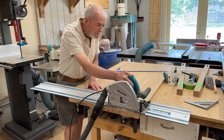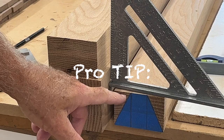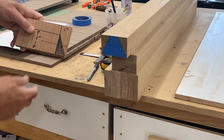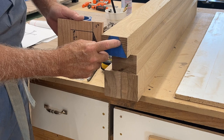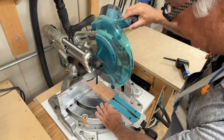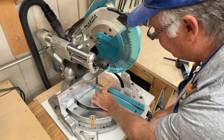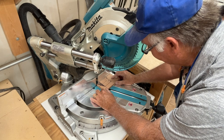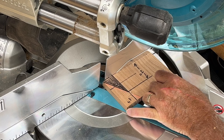Today's tip is how to measure an acute angle. When you want to cut along a line using a speed square it's awfully difficult. I've created a sample block to replicate the angle. First I turn on the laser slider — you can see the red line, which shows where the cut would be. I loosen up my angle, turn the block over, and rotate it until the red line matches up with my preferred cut line. We have that at 27 degrees.